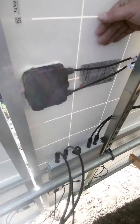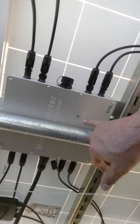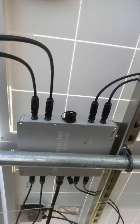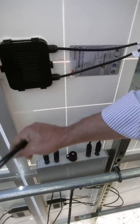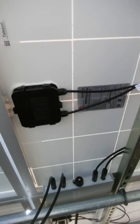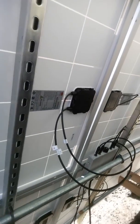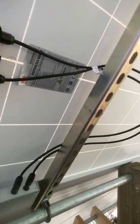The unit is hot, and the panel itself is actually pretty hot too. You can see an indicator here — a blinking green means it's searching for maximum power. When it goes red, it's in anti-islanding mode. It comes standard with regular connectors, so the panels are just plug and play. Right now it's about high noon and we're generating just over about 900 watts on 290 watt panels.